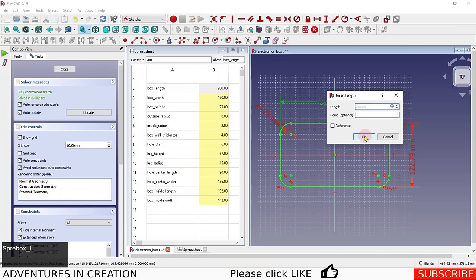This parametric box is very useful for 3D printing electronics enclosures — I've been using them for Arduinos and Raspberry Pis. You take this as the basic box and then cut whatever holes you need for your electronics. Here's the final version with the lid on it — the lid is also parametric, with holes lining up and a small detent on the bottom that seats into the box.